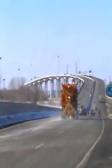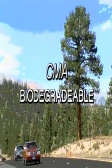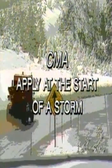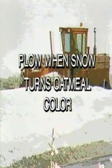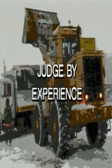Let's review the characteristics of CMA and its proper use. CMA is non-corrosive, preventing damage to bridges and highways. It is biodegradable, posing no threat to the environment. Like road salt, CMA works best above 20 degrees. To be effective, CMA should be applied at the beginning of a storm, before ice forms, and before traffic packs down the snow. CMA-treated snow becomes fluffy and turns an oatmeal color, signaling time to plow. It works longer than salt, requiring less frequent application. It may take some experience to determine the right amount to use depending on climate, traffic volume, and road surface.